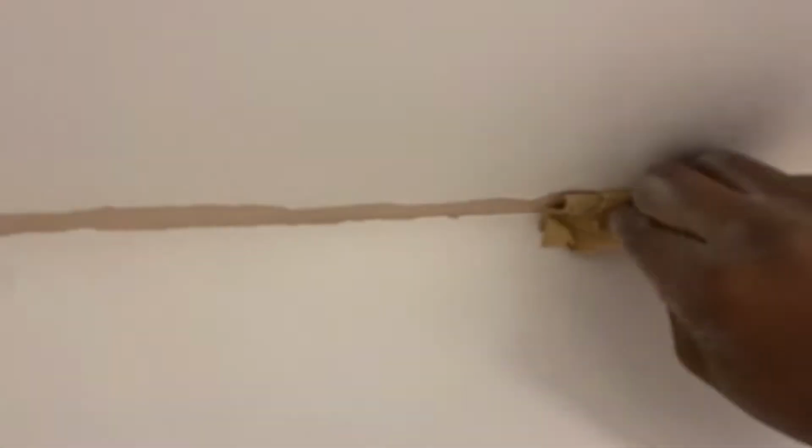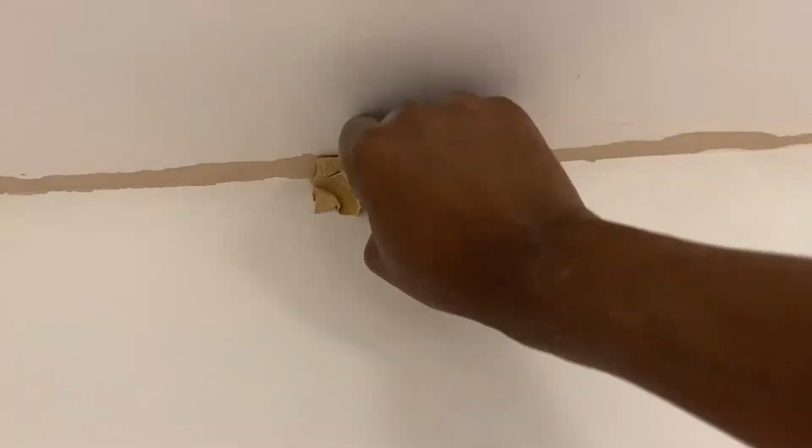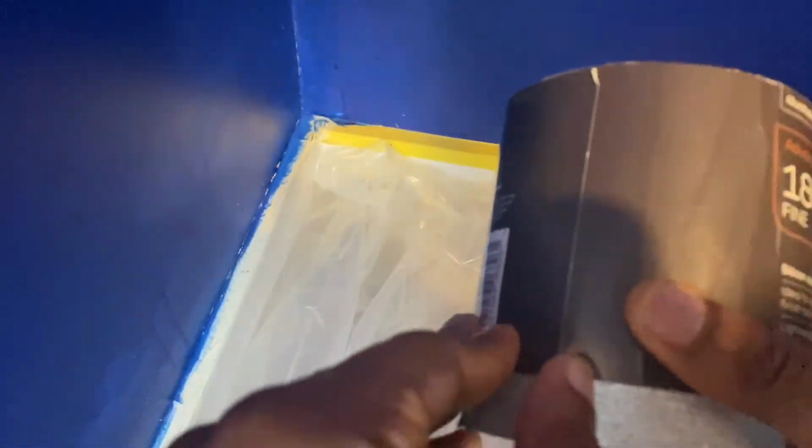I necessarily wouldn't need to use the ready to fill filler or putty onto the roofing. So I'm pretty much using the 80 grit sandpaper to smoothen out the trim edges, and to sand down the areas where I've taken the flaky paint off. I would be using the 180 grit sandpaper to smoothen out areas on the wall where I've applied the ready to use filler. The 180 grit sandpaper produces ultra smooth surface finishes.